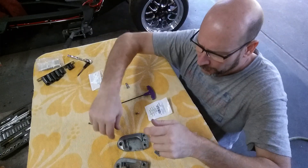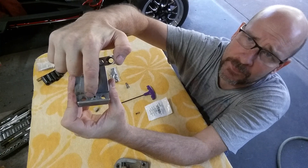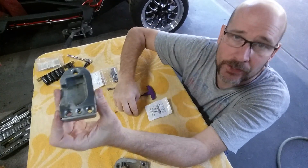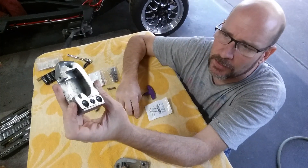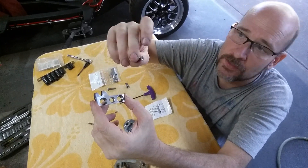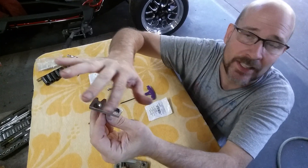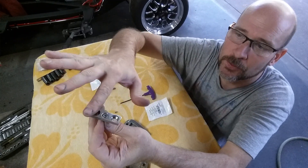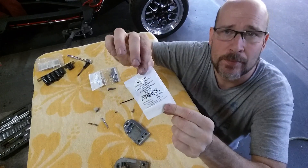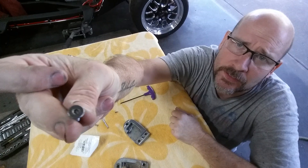Once you get that drilled out and get your plate off, I ground the pad down right there about halfway because it's too tall otherwise. Then you can put the plate back on and I drilled and tapped it to 10-32. I took the plate down to Lowe's and went through the stainless steel countersink Allen drawer until I found ones where the head is a perfect fit — I didn't want anything sticking up. The 10-32 was perfect because it fits flush. I bought a four-pack at Lowe's — I think it was like three bucks. They're Hillman, 10-32 by half-inch long, countersink Allens in stainless steel.